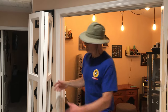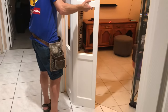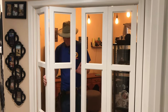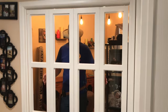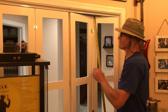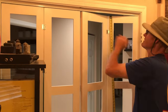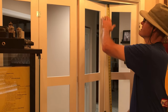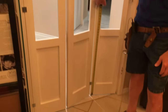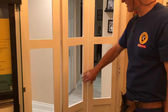Let's get the door fitted in there. Let's see how they fit — oh yeah! Let's talk a little bit about the hinges now. For the hinges, we used a surface mount — we're going to paint them white. For our hinge placement, we went six inches to the center. We also did the same on the bottom, six inches up. And then we just found the center of the door and mounted the center hinge there.